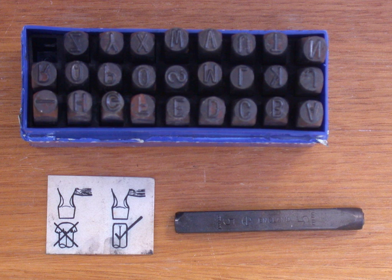When choosing a roll pin punch, select one that is no larger than the compressed diameter of the pin. If a punch is used that is larger than the pin, the surrounding metal in which the pin is seated can be damaged. Also, a roll pin punch should not be used which is smaller than the compressed diameter of the pin, as it may be possible to drive the punch through the hollow center of the roll pin.